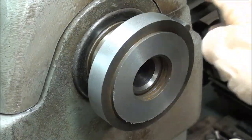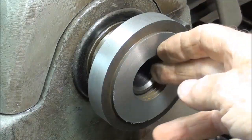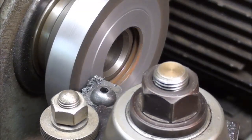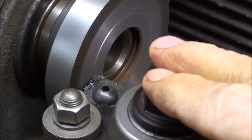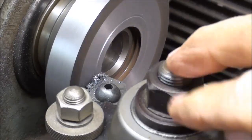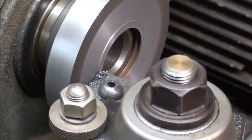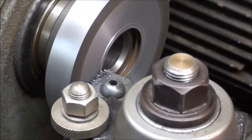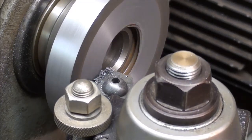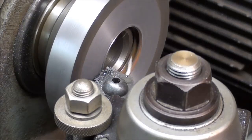These castings were really rough machined such that all the surfaces needed to be remachined other than the thread or maybe the backside of it. When I said these were rough castings I meant that the dimensions were rough — they actually were machined quite nicely and this is very free-machining, nice gray cast iron. I'm very pleased with it. I've just about finished facing off the registration boss, which was about an eighth of an inch. I'm still going to reduce the thickness to about another sixteenth, and then I can start machining the new registration boss.